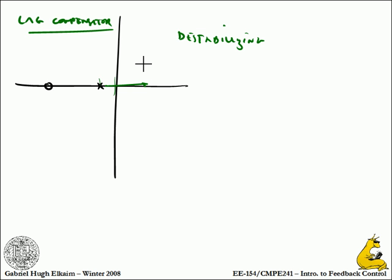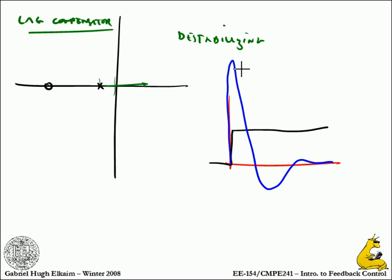Okay. So now, the other problem that integrators have is that if I have a saturating control. Say I put an input in time, I give it a step in, and the output is going to jump way up and do something like that. So this is U, and this is R. This is a typical system response where I hit this with an infinitely fast step. This thing jumps up to infinite and then comes back down. It says, push on the system hard, and as I get close to where I'm going, the output looks something like that. As I'm getting there, it slows down how much it's pushing. I overshoot, it corrects the other way, and it comes back down.